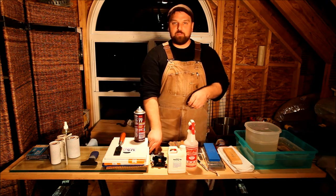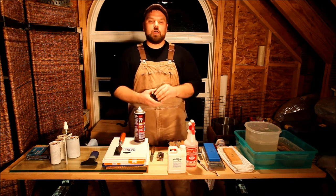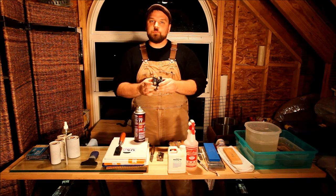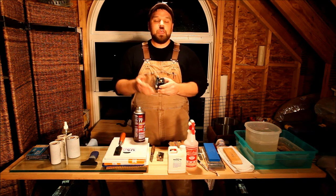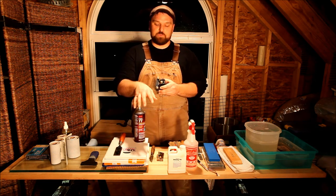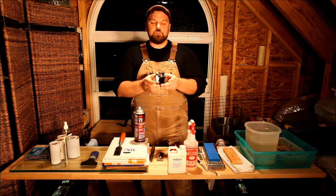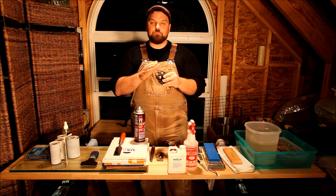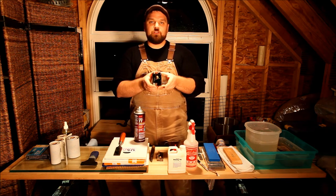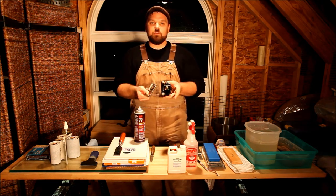In order to put accurate bevels on new tools or chisels that I prefer to keep at exacting angles, I use a jig. As I mentioned in a previous blog entry, a lot of professionals are a little wary of the jig in that it takes some of the skill out of sharpening. I do hand sharpen a lot of my tools and I'll cover that technique, as well as hollow grinding on the grinding wheel. But the jig is great for setting up a new tool to get that first angle on there, and it makes it easier to find that angle when hand sharpening later. This one is by Veritas — it's easy to put together and find angles.